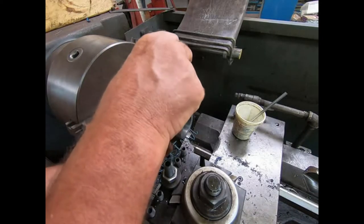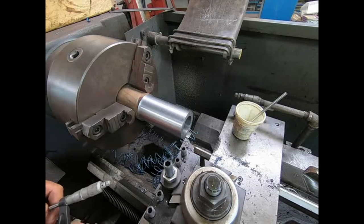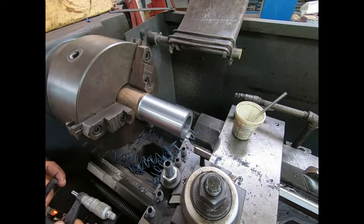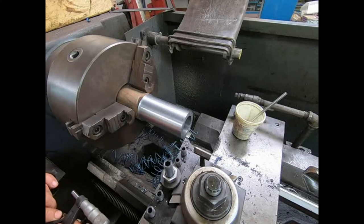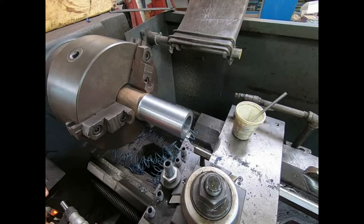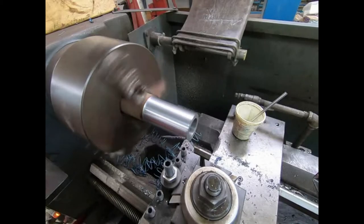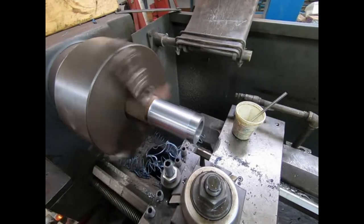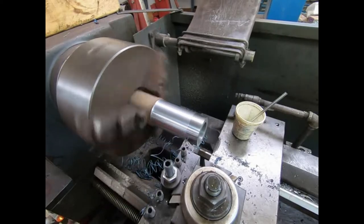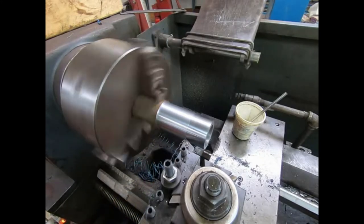Close we're getting. So we're right at 250. Well, thousandths less, but yeah, if I take about 15, should put me damn close to where I want to be. Try it right there and see what happens. Probably got a bird's nest on me, but you know it's given the best finish I've had yet, which is a good thing. Get out of the way before I get half-fooled with that.